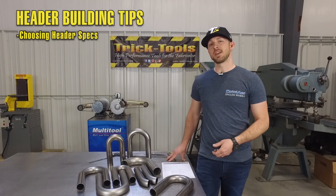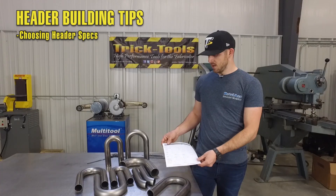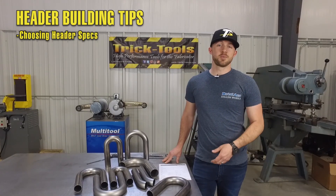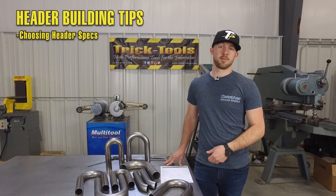If you're trying to squeeze every last bit of horsepower out of a high performance engine, you can get with SPD. They have a vehicle spec form that you can fill out, hand it to them, and they'll create a custom recipe for coming up with the best application for your headers — what size primaries you need as far as the length and the outside diameter.